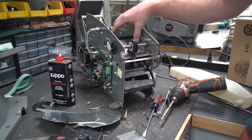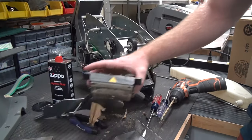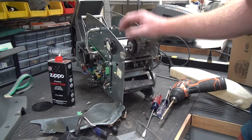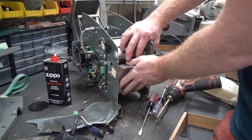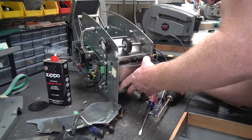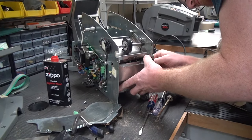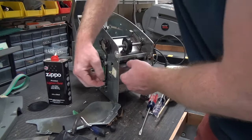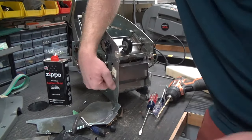Now that I've cleaned off this lower tape plate, blown out the machine, confirmed that the heater works, and confirmed it did attempt to dispense tape, we're able to button everything back up. I like to start by putting in this plate first. Remember what I mentioned about the different screws. This plate does not have the three screws — sometimes you'll have to push the plate up, down, and around to align the screw hole. There we go — one side, two sides.